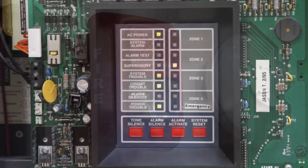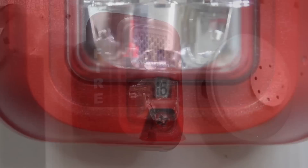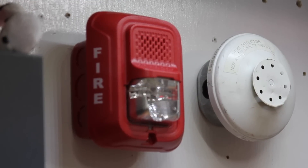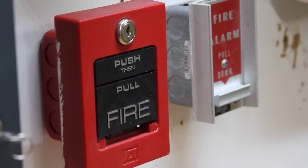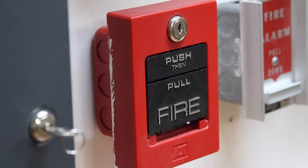Let's go ahead and take a look at the devices. For the notification appliance in this test, we have the System Sensor P2WRL horn strobe, set on 15 candela. And if we look to the right, we have an Edwards heat detector — I believe it's 135 rate of rise and fixed. The pull stations in this test are both ADT. The one on the left is an ADT 5060-S, and on the right it's an ADT B5009-0110. We'll start off the test by pulling the ADT pull station on the left.